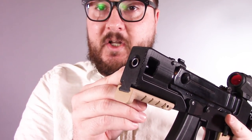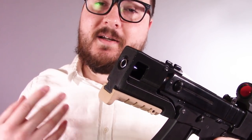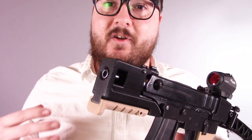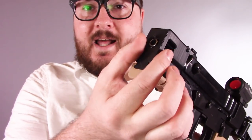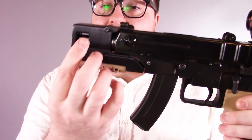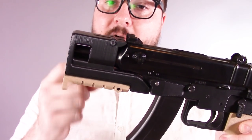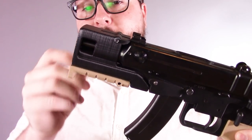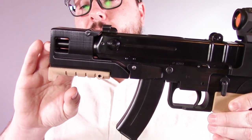I went through a couple of different iterations of this. One version had the barrel set back a little more, sort of recessed inside. Most of the 3D printed stuff I'm doing is with 22s, and muzzle blast out of a 22 or a 32 is not that big of a deal, but just to err on the side of caution I shrunk this down a bit so the muzzle doesn't have any interference for that muzzle blast. There's always going to be a concern about PLA getting too hot, so as with many of my designs I integrated a vent system here that allows airflow so you don't have hot air building up around the barrel. It is open all the way through, so you have a good amount of air space and the barrel shouldn't be interacting too much with the handguard.